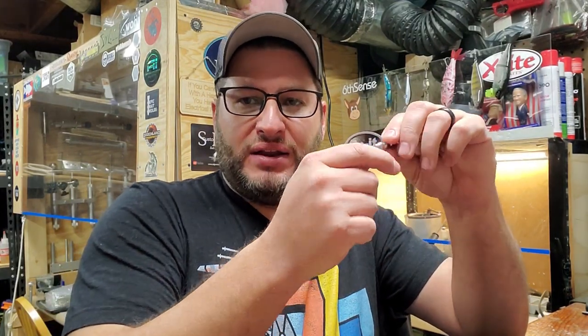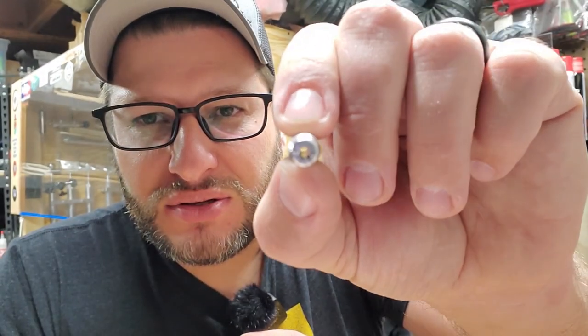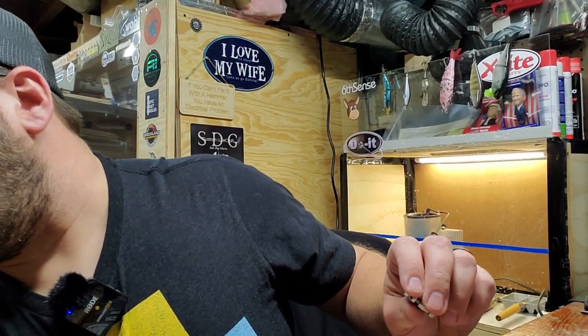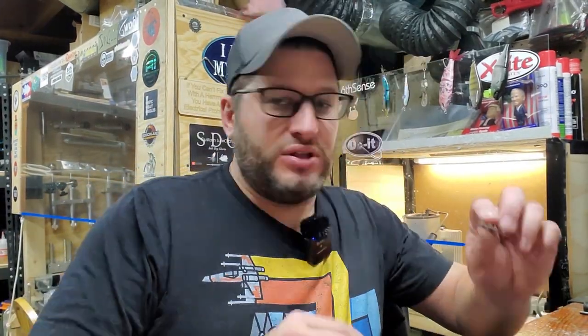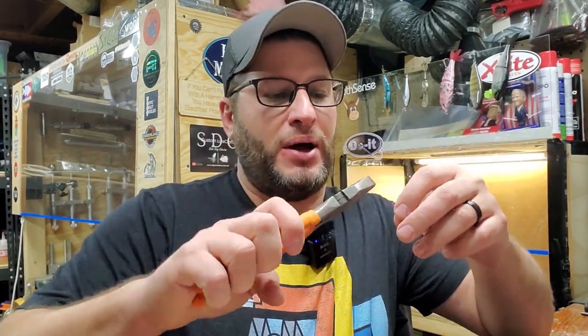The only problem with that is that you have to drill out the hole again that goes down through the middle of these, because there's gonna be some paint that gets stuck in it. And I believe I found a drill bit here somewhere. I don't know what I did with it. I know it's here somewhere, we'll find it. But take a drill bit and I put it in here and use a pair of pliers like this, and we just grab onto it and twist it through, and it cleans the hole right up.